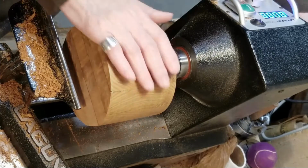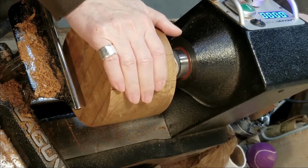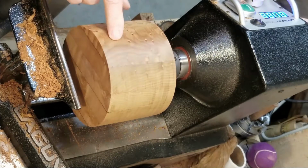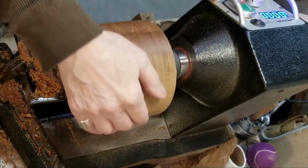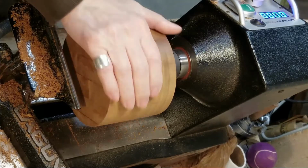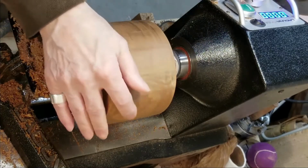Oh, the one thing is this wood has a smell. It's really dusty because I think it's so dry because it was scorched. It was cooked in the kiln at elevated temperatures to turn it brown. And the brown is caramelized sugars that are present in the wood, which is why it's brown. Well, it has a distinctive odor. I can't say it reminds me of good caramel candy bars, but it's not far off. It makes me sneeze, so I've been wearing my dust mask for sure.